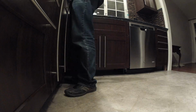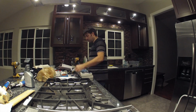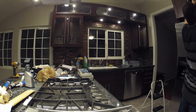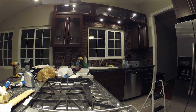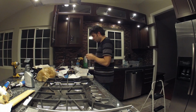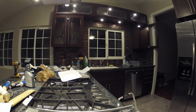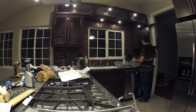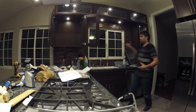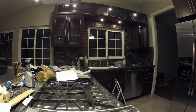And yeah, as I mentioned, I put the bottom trim on under, so you can't see under any of these cabinets when it's all finished. It has a matching base trim, and for the base trim you just attach these snap-on brackets, and they just snap right into the bottom. It was really easy to install. It's pretty secure. Once it's down there, it's not going to go anywhere. And if you do need to remove it for some reason to get under there and clean out something or get access to something, you can pull them off. They'll snap back off. So on this cabinet on the left, I used an extra wide opening hinge. It opens 150 something degrees, just so this door can open up extra far, and it's easier to get in there from the corner of the countertop there.